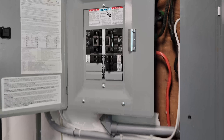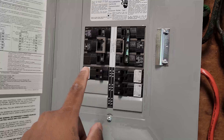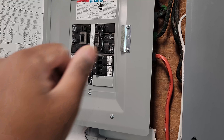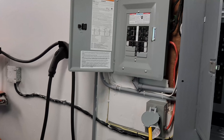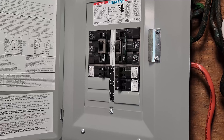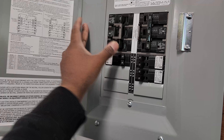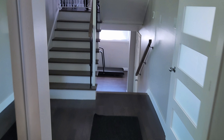You're not getting 240V — that's not the point. The goal is to power both legs of the panel. After the 5-30 to 14-30 adapter, you use a generator cable of appropriate length. That plugs into the 14-30, and finally into the generator inlet. So the chain is: car V2L → 5-15 to 5-30 adapter → 5-30 to 14-30 adapter → generator cable → generator inlet → panel breakers.